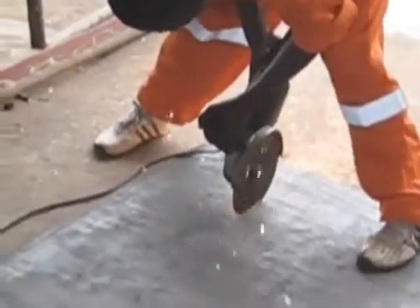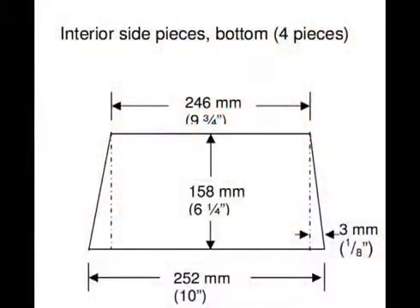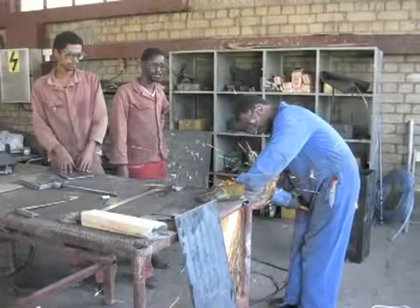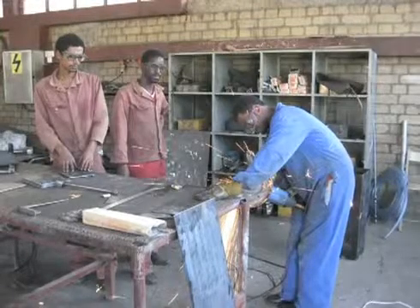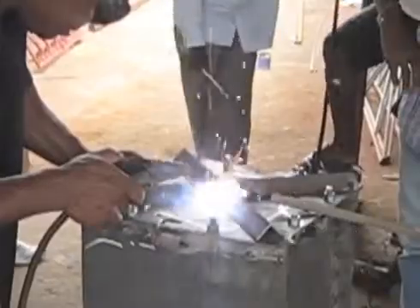After drilling the holes, you will be cutting the 6mm thick steel plate. This sheet will be cut into 4 interior side pieces and 1 base plate piece. If you can't find 6mm or 5mm plate, you can also use 3mm thick plate steel, but this will make your diffuser ledge much weaker, so you will need to reinforce your base plate with longer square tubing or angle bar.